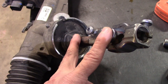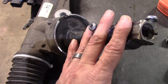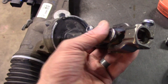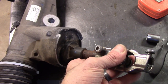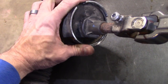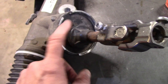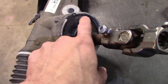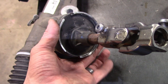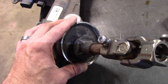In the stock location, this is basically exactly where the axle has to go through. Up until about a month and a half ago I was thinking the rack had to go on top or over the cross shaft, but now I've had the revelation that it should really go below. I'll basically have to lean the rack in that direction, which helps a few things. But this huge bulbous section is still problematic. Inside there's an encoder and the rest is just empty space — so why isn't it smaller? Anyway, I'll mock it up in the car and show you what I'm trying to address.